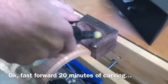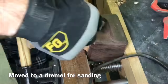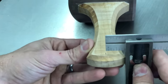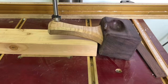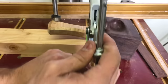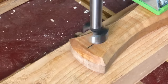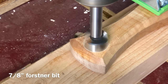The last thing I did was move over to my Dremel to take out the last little scratches. I've gotten in the habit of putting a copper ring on all the mallet handles I make — it's really just for convenience but they end up looking cool too. For this one I'm doing a 7/8-inch copper ring from copper pipe from Home Depot. When drilling these, you want to clamp them down to a sacrificial board underneath — this prevents you from blowing out one side on the drill press.